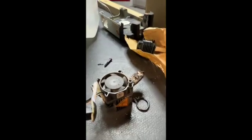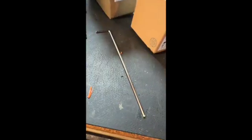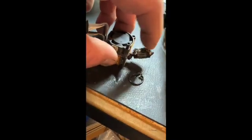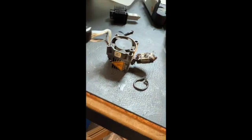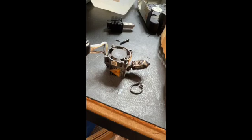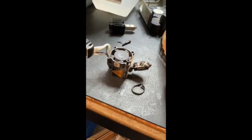Something I like about Bambu is the availability of replacement parts. 90% of the fasteners are the same Allen head size, which is awesome when you go to change it out. What I'm trying to do is do the replacement head, and hopefully the components that tie into it are still good, so I can salvage it without having to do a full hot end or full assembly replacement.